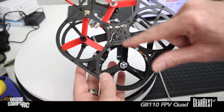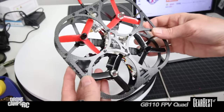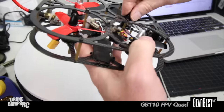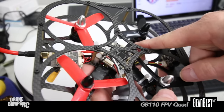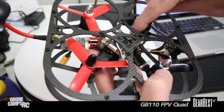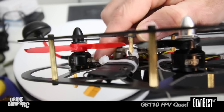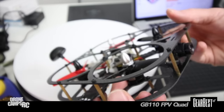These ESCs are really really tight in here. I've seen some tight solders coming from China recently, and these are some of the tightest, shortest wires I've seen soldered up in a kit so far — there's hardly any room between the motor and the ESC. Watch out for this: the motor bell spins inside here, and you need to make absolutely sure that your wires coming off the end of the ESC aren't touching the bell. I do a finger test and rotate my motors to check they're moving freely. If they feel like they're snagging at all, look closely at your ESC and make sure the wires are not rubbing on the motor — that will rub through the wire, short out your quad, and you'll see a puff of white smoke.